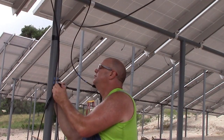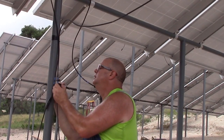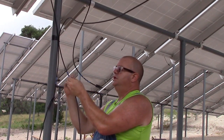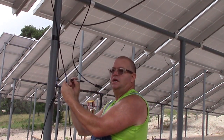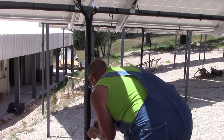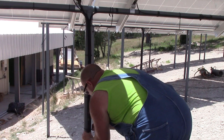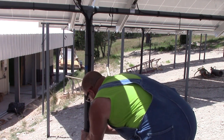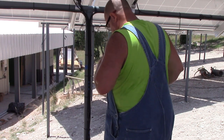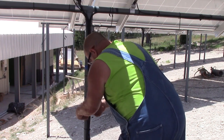To keep all these color-coded — this is Blue Array String 2, I've got it with a positive for male. Keep everything in order so you can wire it in order. Keep switching and breakers in order, and so whenever you're ever troubleshooting, it makes things much easier.